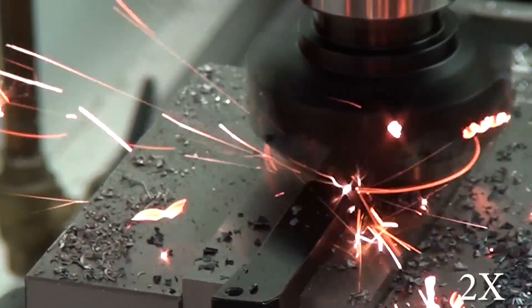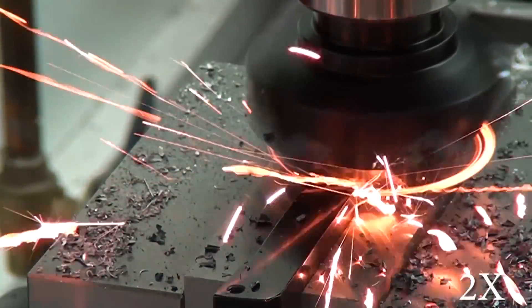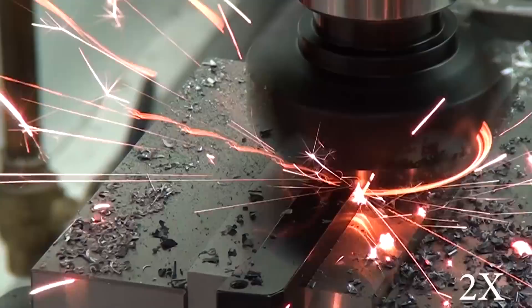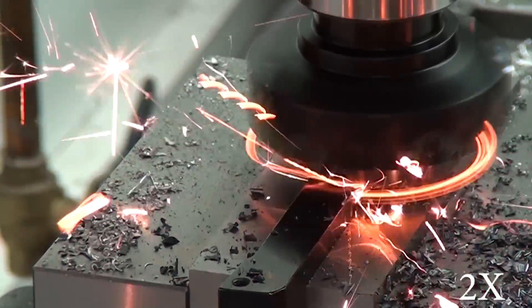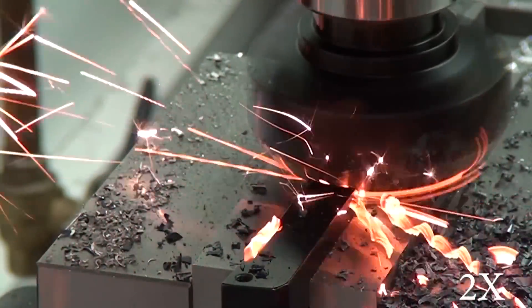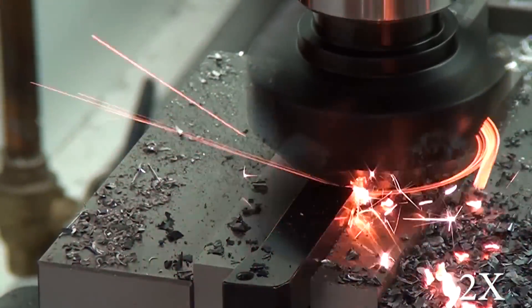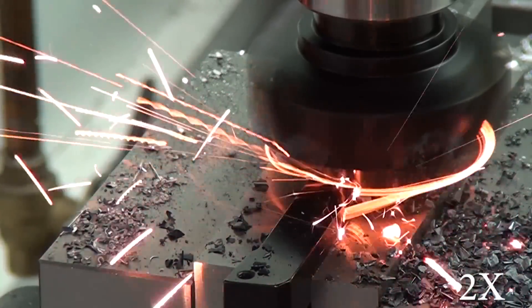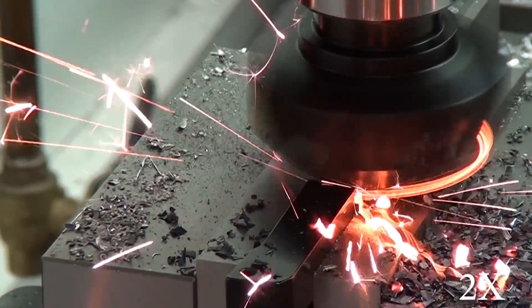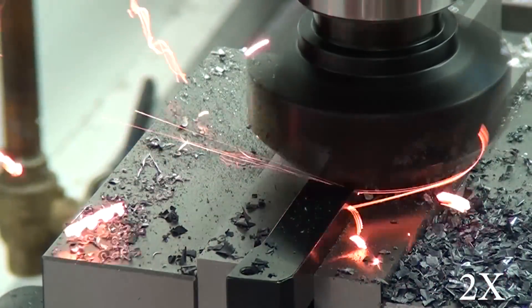I was impressed that my face mill was able to start working right through the material at a ten thousandths depth of cut. I started to become concerned when about halfway through, I noticed I was really turning the hand wheel slowly — barely advancing through the cut and I couldn't figure it out. At first I thought maybe my inserts were already dying. They're cheap Chinese Shars brand inserts, so I thought maybe the inserts are toast and that's why I'm not able to cut along.